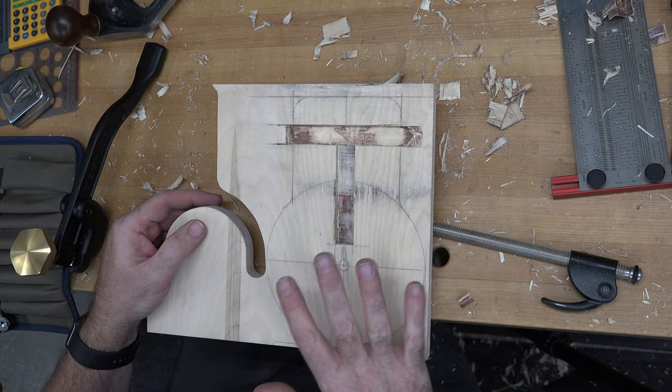You can cut this however you want — hand tools, scroll saw, whatever you like. I'm going to take it to the scroll saw and cut that out quickly. It's now time to drill the holes for our gusset. I've marked a couple of holes here in our fret saw table and I'm going to drill those through, dry fit the piece in, and screw it in using some number eight screws countersunk into our tabletop so they lie nice and flush. Then we can glue and screw that gusset into place.